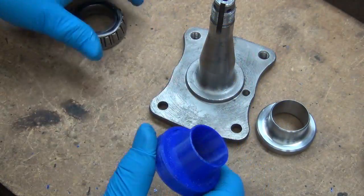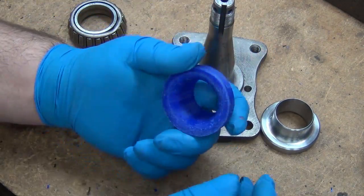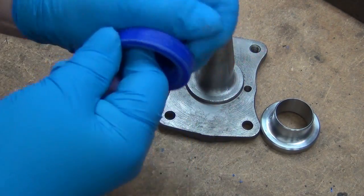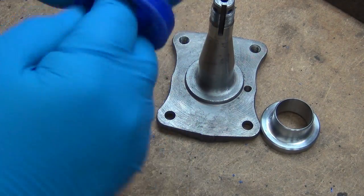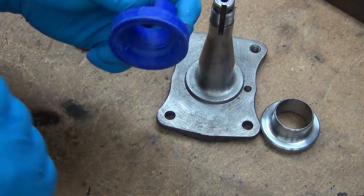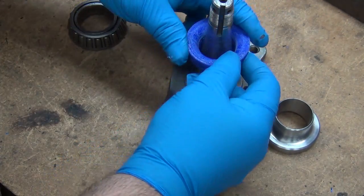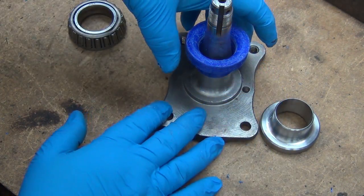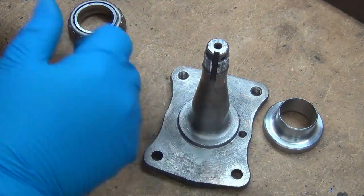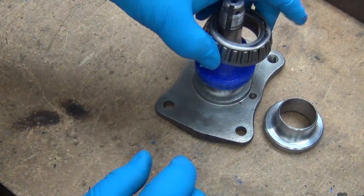It fits here — it's a little looser than the metal one would be, about ten thousandths too small on one end, and a little too tight on the other. A little sanding should open it up, and push come to shove I can put it in the lathe and spin it. Even on the metal ones I sometimes have trouble with this transfer being too tight — oh, it's close, I can see it stretching and flaring out at the bottom. I don't want to break it.